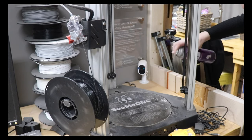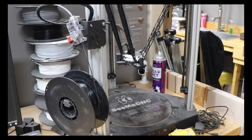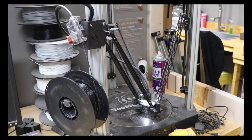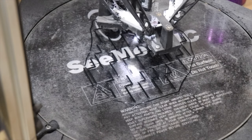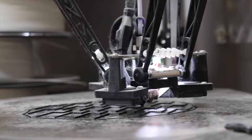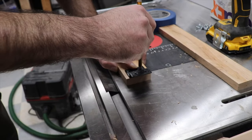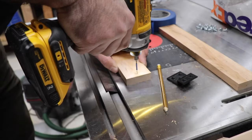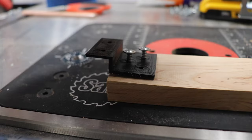To secure my corners, since there was an offset in the thickness of the board, I 3D modeled a set of custom brackets and 3D printed them on 100% infill in black PLA filament. These fit perfectly onto the cherry I had cut for the face of the nightstands as dividers between each drawer. I then screwed everything into place.